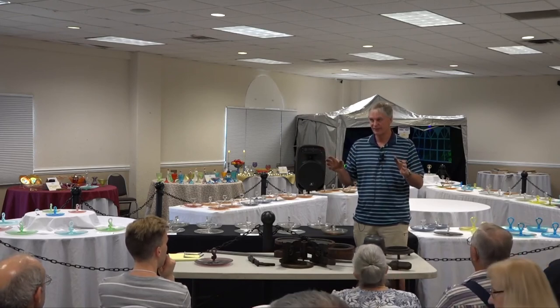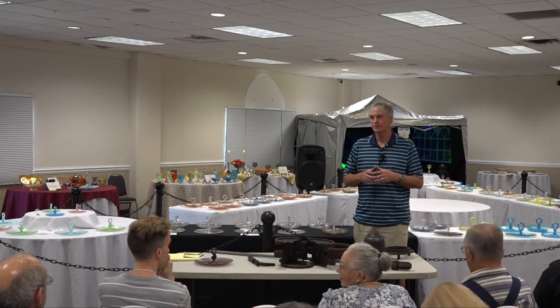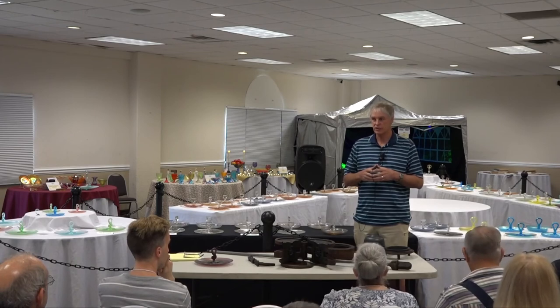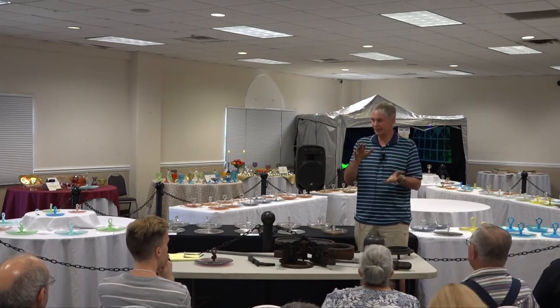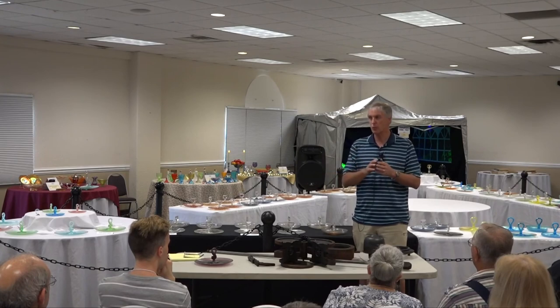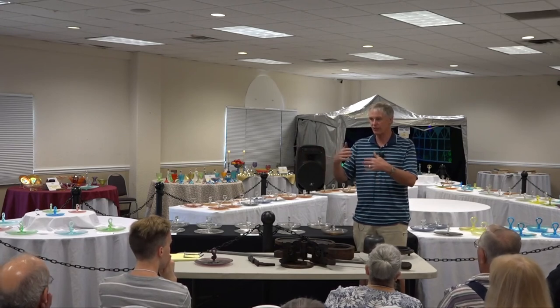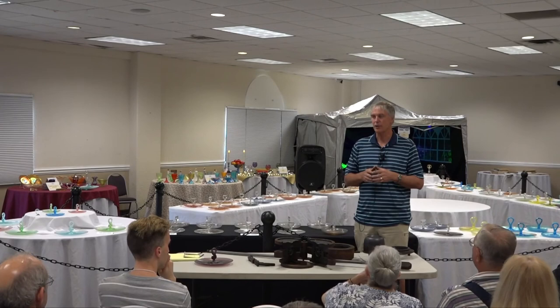Well, that's more where the question came from. I think that was particularly early on, when they didn't call it Amberina, or they couldn't make it consistently all the time. Because every piece might come out a little bit different. Thicker or thinner would make a difference in terms of color. How long the guy warmed it would make a difference. Whether the first person dropped it and the next person got through the process faster would make a difference. If he had to wait for the person in front of him, that could make a difference in the color. All of those very slight variations could create the kind of variations that you see in the marketplace.